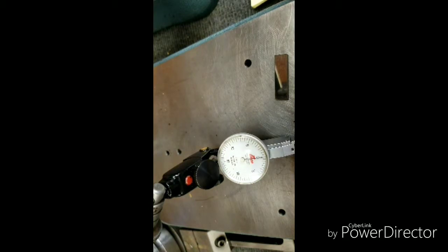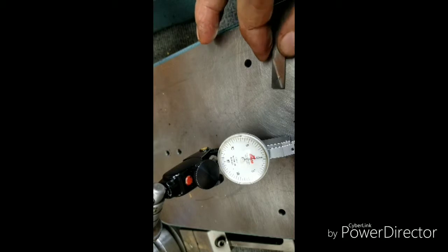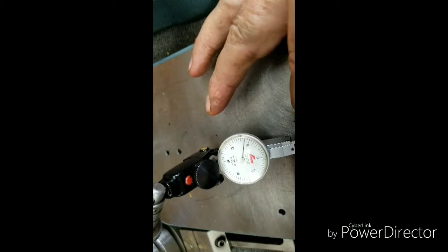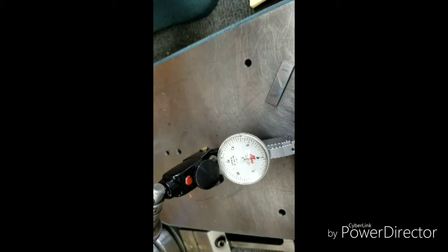We've got a 117 and a 123 gauge block. The 117 is checking, so that means the 123 should be right on zero. The deviations on the others — one was one way and one was the other way, so that made it look even worse. But I'm proud of that — looks like it's right on the money.